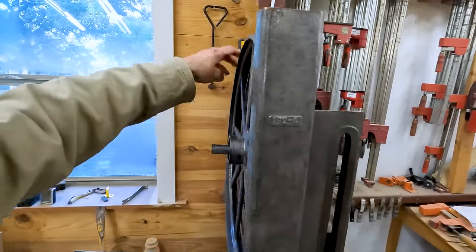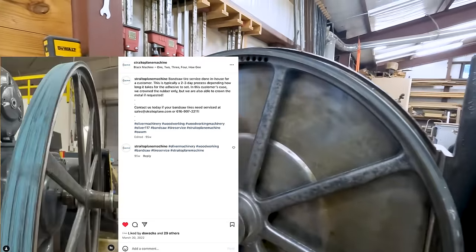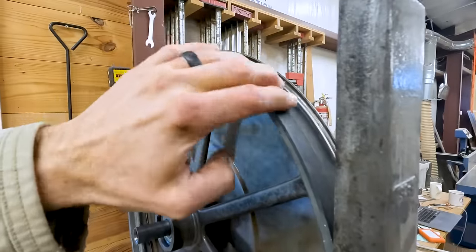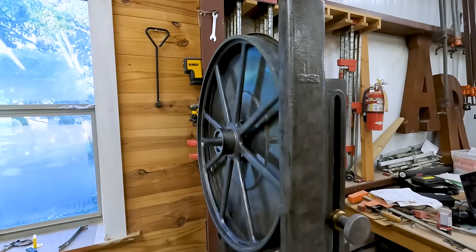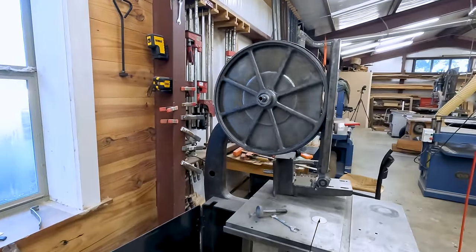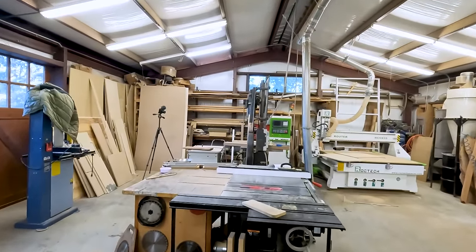I have to share this — it's in the last video, y'all are probably aware. I sent these wheels to their shop, shipped them up, and they tired them. They got nice new tires on and crowned them. You can see that slight peak right there — it's perfectly crowned right in the middle of the tire, and they did a great job. Having a nicely crowned wheel is a big deal for how well your bandsaw is going to run. From now on if I restore a bandsaw I'll probably send the wheels to them to crown. I might even send the 36-inch wheels eventually, because when I crowned those I did a horrible job compared to what they did.